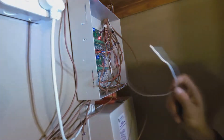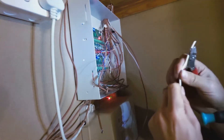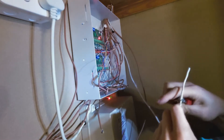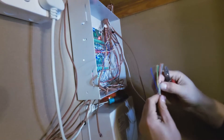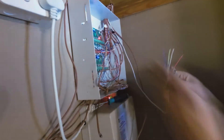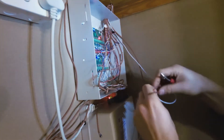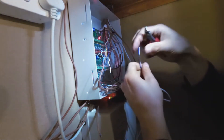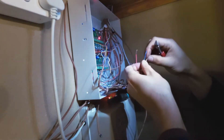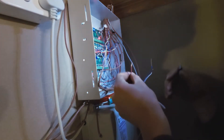Now I need to power it up and connect it to the alarm system. Here is the wire from the smoke detector. It needs to have its power connected to the 12 volts of the alarm system or the battery backup. Because I want this smoke detector to activate an alarm on my alarm system, I need to connect it to the IDS alarm system. I only need four wires — the positive and negative to power the smoke detector, and the signal wires, which are the blue and white, for when the alarm condition takes place.